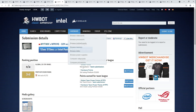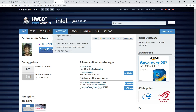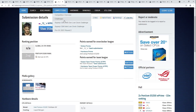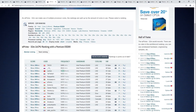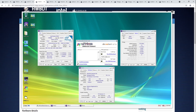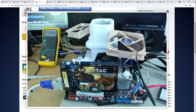This is a very competitive ranking — the third place is from 2019, second place from 2017. A very popular CPU. I don't know much about E5200s, I just know it fits the LGA 775 socket. W Prime is a pretty straightforward multi-core CPU benchmark — more CPU frequency equals more better — and then there's some OS stuff you can do to get it to run faster. Running it on Windows 10 on an older platform like LGA 775, you're probably not going to get anywhere. For the motherboard it's an Asus Rampage Extreme, probably the most popular LGA 775 motherboard for competitive overclocking.